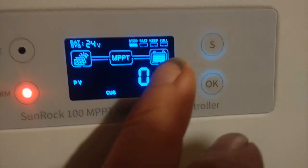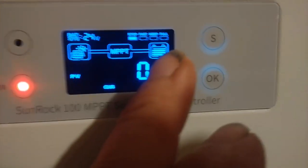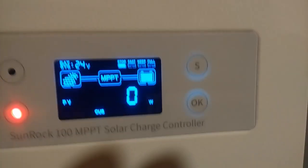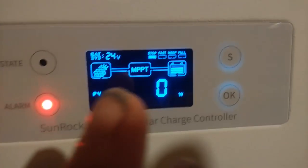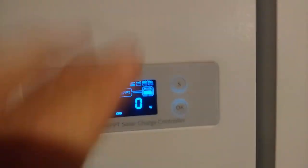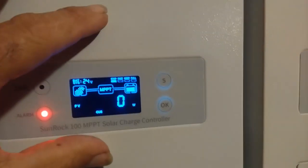Well, anyways, this solar panel, MPPT and battery indicator that you've got on here, this is eye candy for the dumb. This is absolutely not necessary, and that space could be used for more important information. In fact, you need to expand the size of this display and put all the pertinent information about this charger. The battery voltage, the PV voltage, PV watts, PV amps, all that stuff should be able to be seen on the screen. As you can see here, I've got all these meters up here to monitor all that stuff, because it's such a hassle to go up here and push the button and find out what each function is doing. So if you had all that on the same display, you would make most off-gridders real happy campers by doing that.